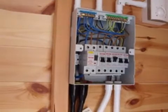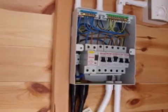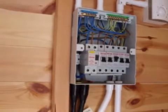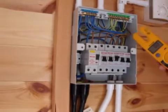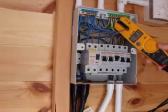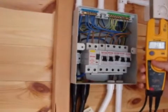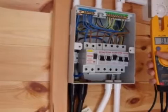What we're going to do now is test the load current on one of the circuits - the heater circuit. It's got a 16 amp type B miniature circuit breaker, a BS60898, and Craig has wired this in with what looks like 2.5mm single PVC cable. We're going to set it to amps and insert it on the line conductor - you might be able to see the reading on the display at 8.1 amps. We can press this button here and it will hold that reading at 8.1 amps, which is useful when the display can't be seen properly in poor lighting.